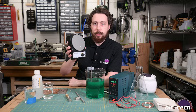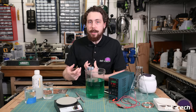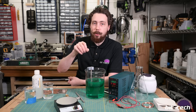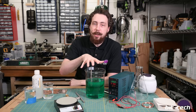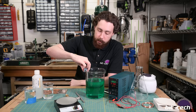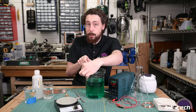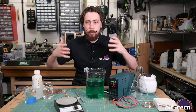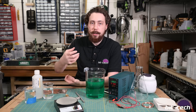One little parting point: if you're having trouble getting bubbles on the surface to disperse, use a magnetic stirrer - there's a little flea at the bottom that keeps the liquid moving around the part, pulling bubbles away so they don't grow large and interrupt the plating. It's also great if you've got lots of little parts to plate. Another tip: using a larger anode gives fewer shadow problems, since ions flow from a larger area - it's like using a softbox for lighting, diffusing the current for more even coverage and better plating quality.